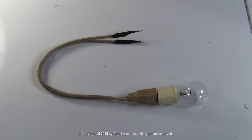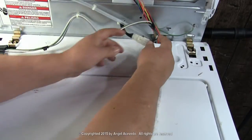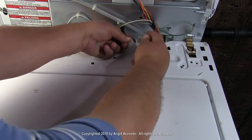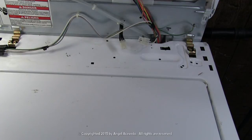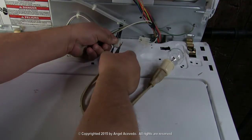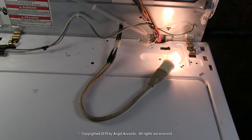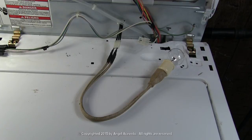You could use the test cord to find out if there is voltage on a washer power cord. With the washer connected to the wall outlet, disconnect the power cord from the wire harness. Stick the two probes of the tester on the cord terminals. If the light bulb lights up, there is voltage in the power cord. If the light bulb doesn't light up, there is no voltage in the power cord.